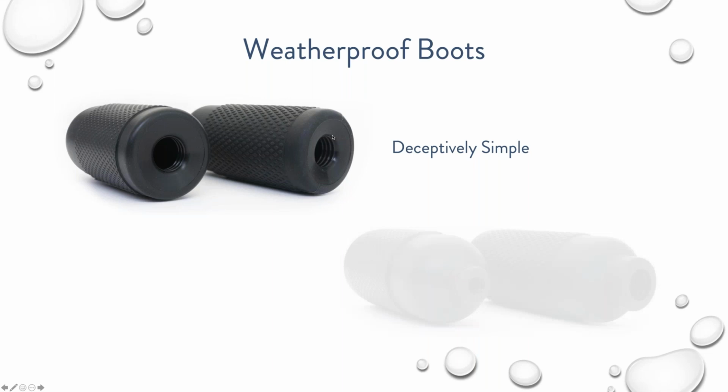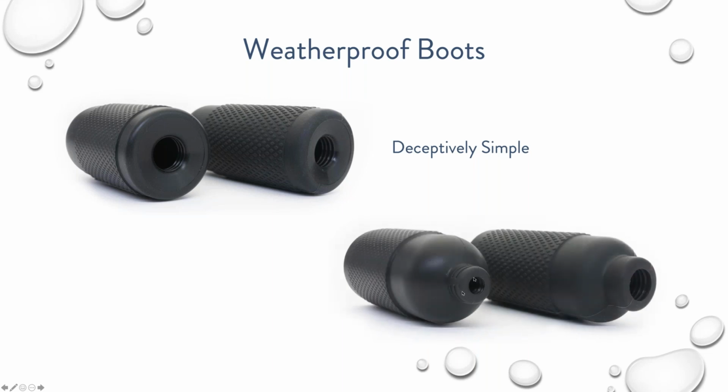And you can see that on the cable side as well. Here on the cable side, you've got this smaller cable here, the larger cable here, and the ridges built in to add a layer of weather protection so that water can't drip down. And it's just a lot packed into these things to make them watertight. And they are IP68 rated. For any familiar with the IP rating system, that's true for also the slide locks and the cold shrink.